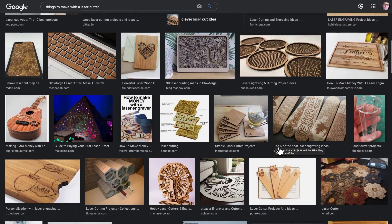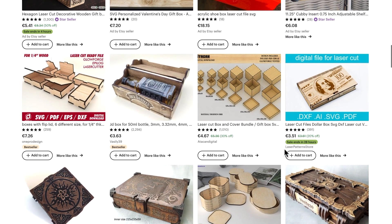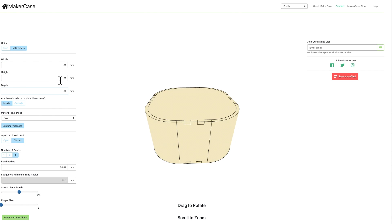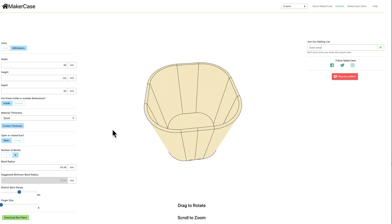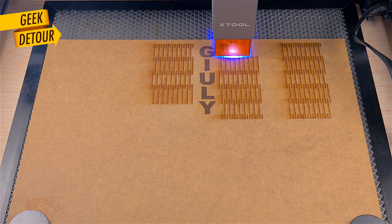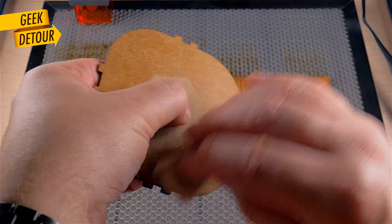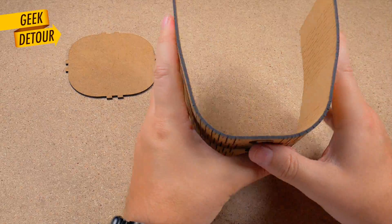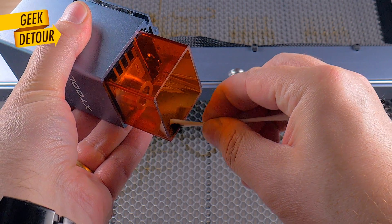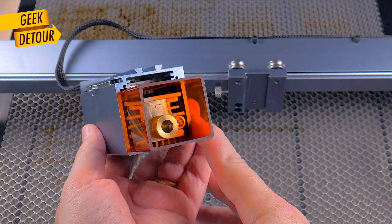You don't need to be an artist to use a laser machine. There are thousands of laser cut projects to purchase on Etsy — and oh boy, so many laser cut boxes. You can also create your own custom size box online using a box generator. Before I assemble the box, let me quickly clean the lens and the shroud again. It is surprising how fast they accumulate burned material. A dirty lens gets so hot it can deform or crack, so I clean mine after every big burn like this MDF box.